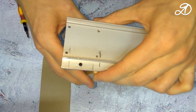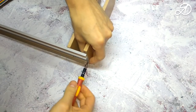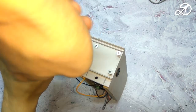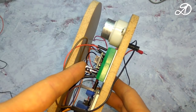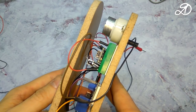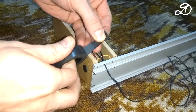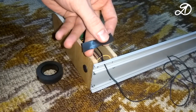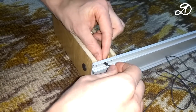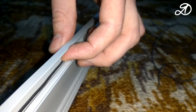Now fasten all the racks on the base. The IR receiver must be within range of the control panel so the lamp is convenient to manage. The black negative wire should be laid along the base to the other end of the lamp. Seal the wire to prevent damage.